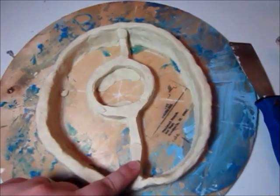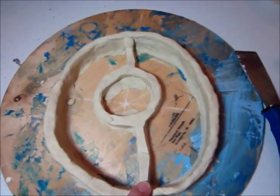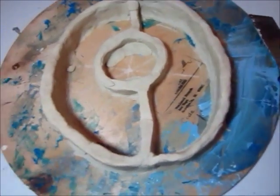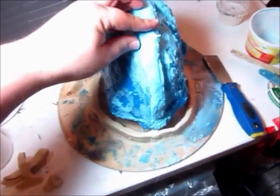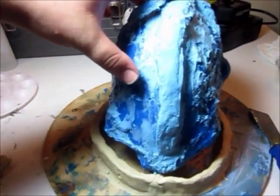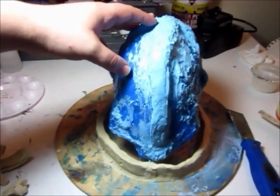So this dividing wall is going to divide the base, and this is going to sit on that little donut, which is going to make up the third part of the mold. So basically the mold is going to sit right here, and the base is going to get poured into here, and then we'll continue the dividing wall that you see right here. We will continue that up and over the top and build up one side and then build up the other side. So hopefully this will make a little bit more sense as you see it in action.